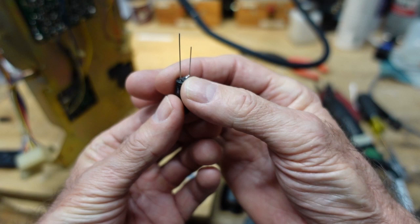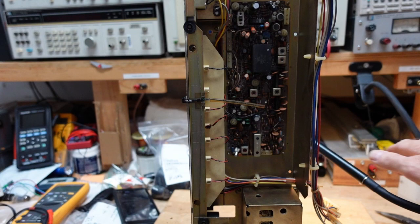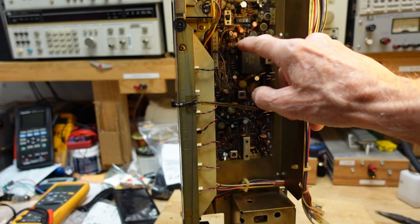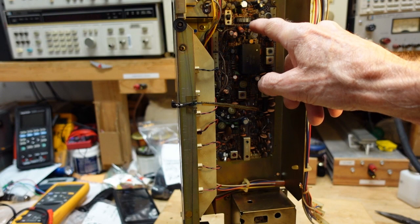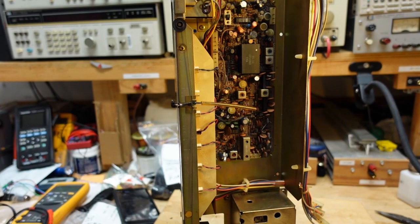Also, you'll notice if you look at the tuner board, let's get some light here. Tuner board has a lot of the orange jacketed electrolytics. Now, if you've watched my channel, I've already explained it, but I just want to reiterate, these are low leakage electrolytics. Values 4.7 microfarad and under, I simply replace with film capacitors. If the values of these are higher than that, you can still get low leakage electrolytics, and that's what I use for that.